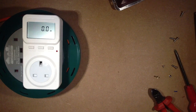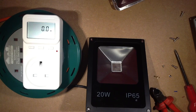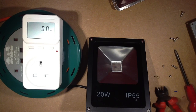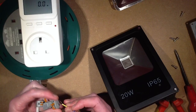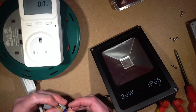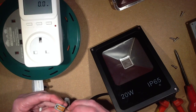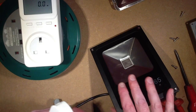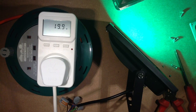Maybe it's just been confused with the electronic supply. Let's use this other fixture I've got — this 20-watt green one, which does have the earth connected because I connected it. Here's the earth. These are WAGO connectors by the way — they're very good; they're really designed for solid core cables. I just roughed this up as a convenient means of quick connecting because it grips them quite strongly. So let's see — this is a green light, I'll point it away from the camera because it's going to be bright. 20 watts. So that other one has just got a 10-watt ballast in it. That's annoying.